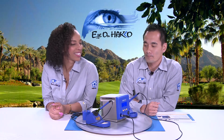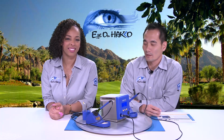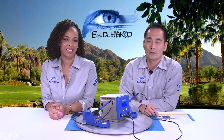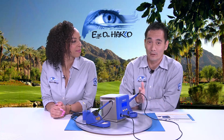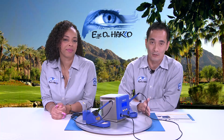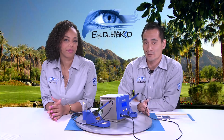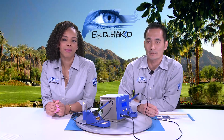So the T35 tips used in the micro iron cover the 2 temperature ranges, the -02 and the -03, which is the 750F and the 660F temperature series. And in the T31s, you have the same selection as well, the black end cap and the white end cap we went over a little bit earlier. Again, it's the same color code. The black is for the 750F and the white is for the 660F. So you do get those 2 selections in the micro handpiece as well.